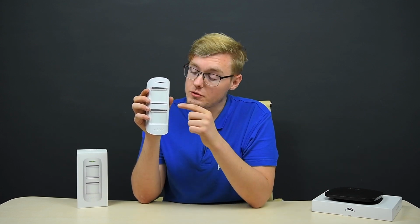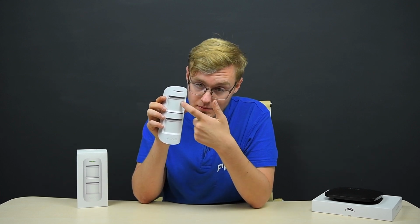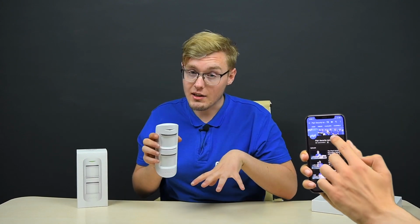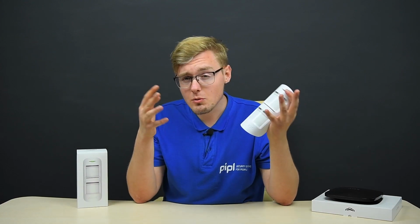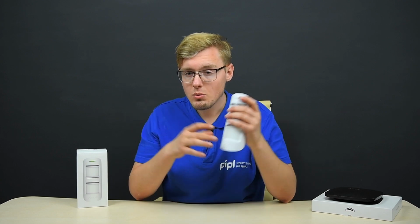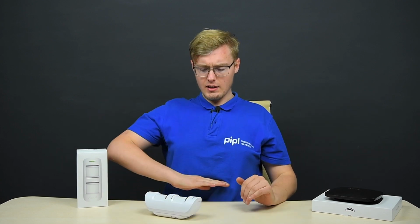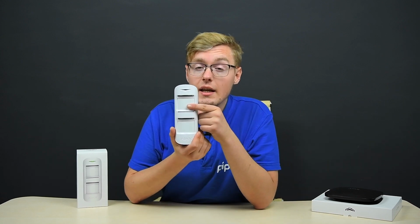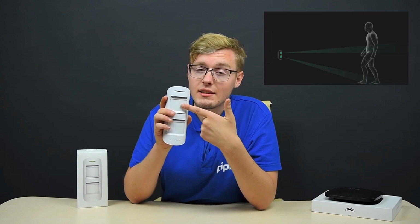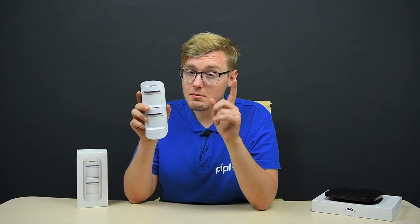And that is why we have 2 infrared sensors built in, because they are working simultaneously in 100% synchronization with each other. The recommended installation height of the sensor is about 0.8 to 1.3 meters, which is approximately the stomach or chest of an average person. So the top infrared motion sensor monitors a straight line direction, and the bottom one is pointed to the area of the shin and feet. As a result, the mechanism looks like this.